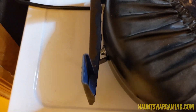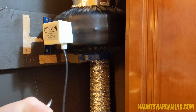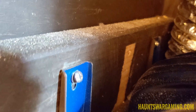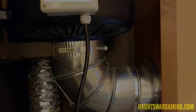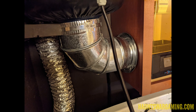The mounting system for this particular fan is a nightmare. I remembered it being a pain the first time I mounted it, and with even less space to work with this time it was pretty bad. I had originally mounted a 2x10 board onto the wall so I could easily move the fan around if needed, and I'm glad I did that. Without a really long drill attachment it's pretty much impossible to get the screws into the bracket dead on — I pretty much had to put all the screws in on an angle. I also have a 2x4 piece that I cut a slight angle on so it would sit flush with the bottom of the vent fan. This not only helps support the fan but also holds the vent piece in place, which is really helpful for my modular setup.